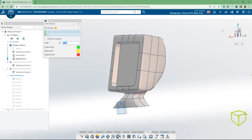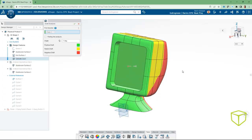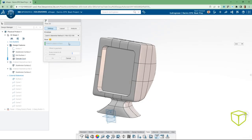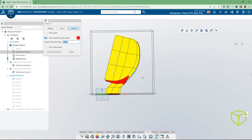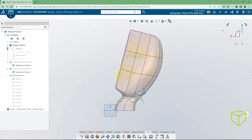Now, draft analysis is a common step when the destination for these parts is the plastic injection molding line. But when additive manufacturing is involved, I'm much more interested in what faces will require supports. The 3D printing capabilities on the platform give us that feedback immediately. Now I can tweak the design a little bit more to make sure that it will print within my necessary parameters.